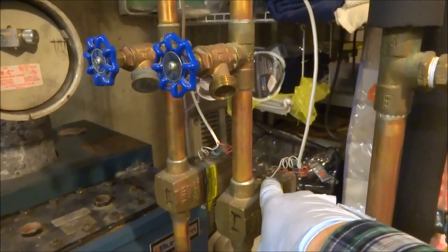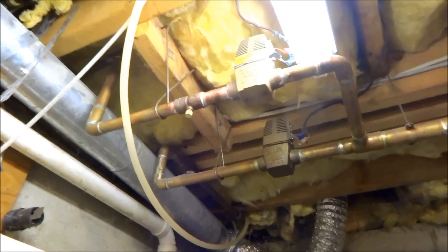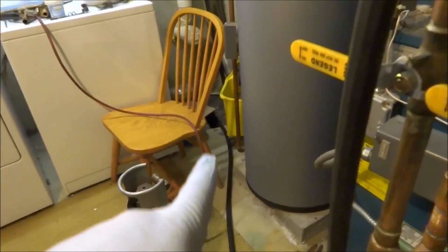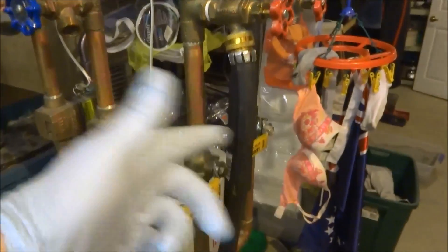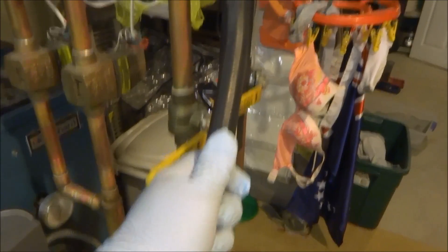These two here are not working off that switch — I've got to go shut these two off on the addition and turn the thermostats down. I don't see any leaks. I've got these ball valves off here — we'll start with this one, this is the one that was in question. We're purging. The water's going up the supply; I've got them bypassed. Open them too, through the zone, back to return, out the hose. It can't go back because I've got the two ball valves off, and these are acting as ball valves. Purge stations — run it until it's clear. I've got to do all four zones.